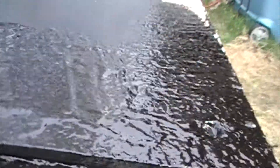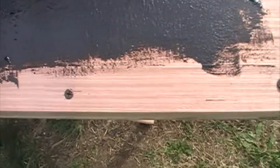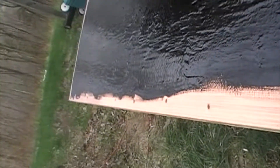That's it for this step. Make sure you fill all the holes — see where the screws are down in there? Make sure you fill all those up real good. And when you're screwing down all on the edges, you want to put quite a few screws — every six inches or so — all the way down through there. Make sure it pulls down good and tight.